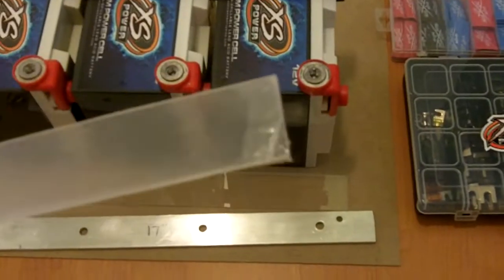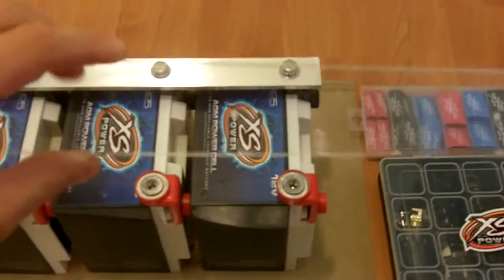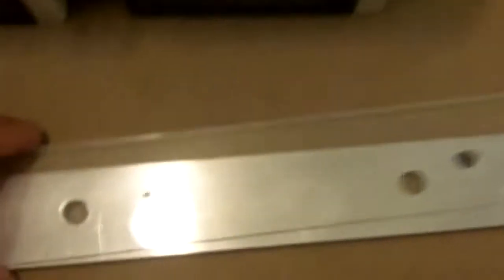There's a protective tape film on it and you just peel that back and what you have is a crystal clear piece of plastic. You can see the little marks I made right there — I basically put it on my terminals, find the center point of each terminal, and mark it with a pin or center punch. Then put it over onto your bus bar, onto your flat bar, and make your marks.